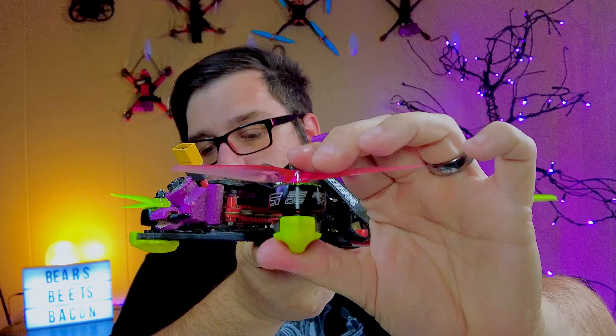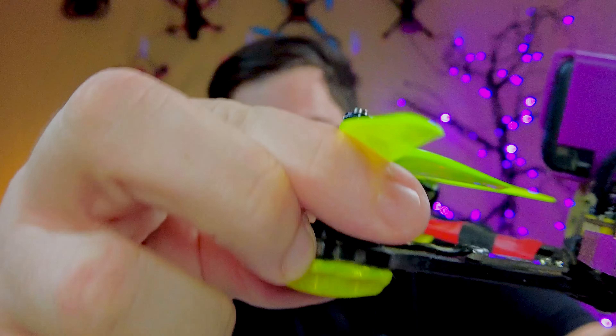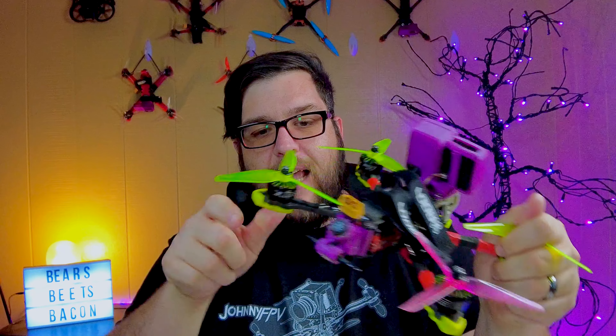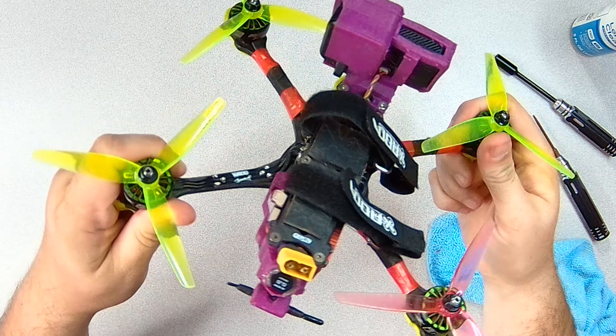Let's look at the other arms — see how I really can't flex it? It moves a little but it's not bad at all. This one, it's a problem. It's a real problem. It turns out what has happened is I delaminated the carbon in this arm. If I twist it just right, maybe you can see it — it's delaminated inside, and that makes it twist. So one thing you should put into your pre-flight check is a twist of your arms. It's very apparent if I grab my motors and do a little twist — this arm is twisting and this one over here is doing nothing at all. This is not good when you can totally twist the motor. And that, as it turns out, was why my quad felt like crap.